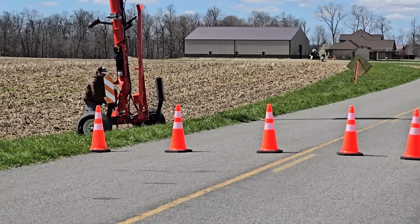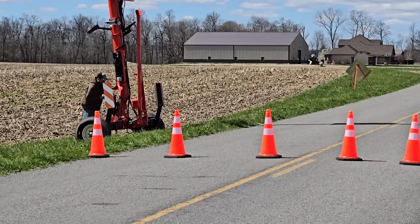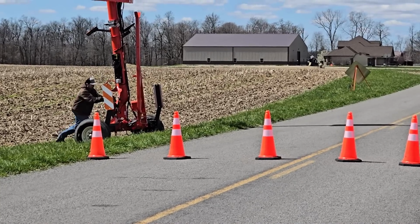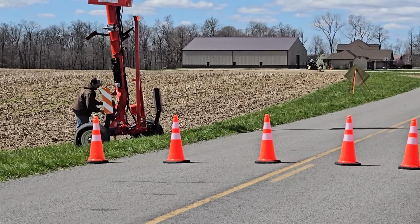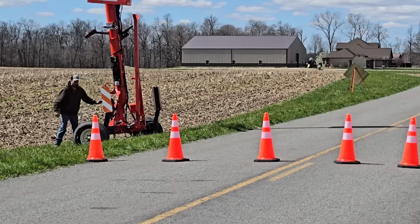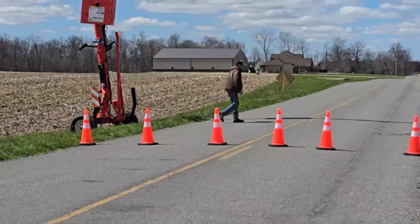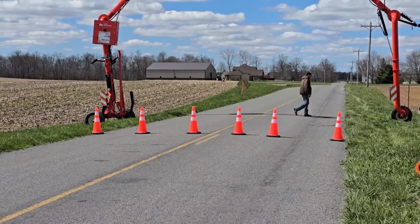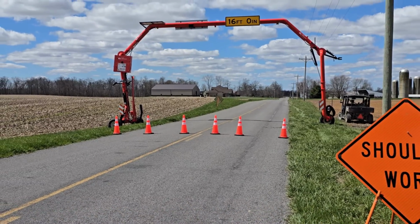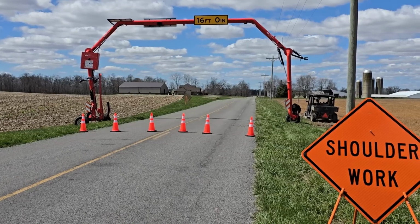Here I moved the pipe bridge back out of level a little bit to prepare for lowering it. I just stuck the lock pin in, and now I'm tightening the lock jack, the ratchet jack, up, and locking the lock nut to keep the ratchet jack tight against the tilt lock pin. Right there I should have lowered the rear transport post, but I forgot about that, and we'll be doing that here in a little bit.